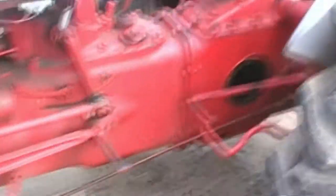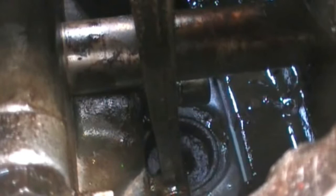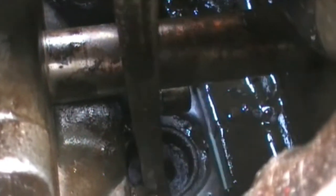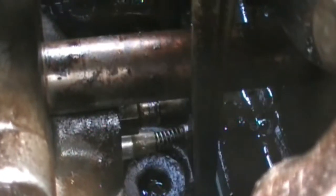You got the Sherman transmission gearbox. Then you've got the regular transmission, and that PTO shaft runs right there through the middle. Now, the valve and the valve fork, you can see now that the valve strokes. You see it in there, stroke? That didn't used to happen. Now that was why the lift would only go up. It was stuck in the lift position.